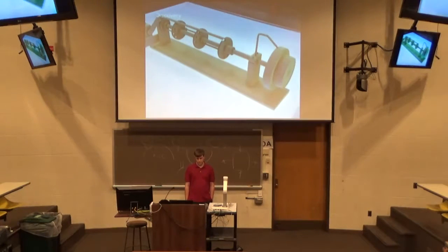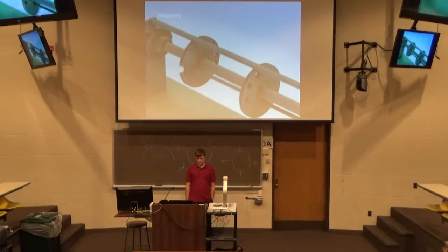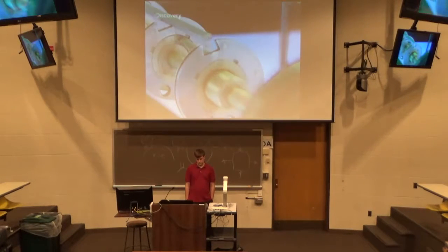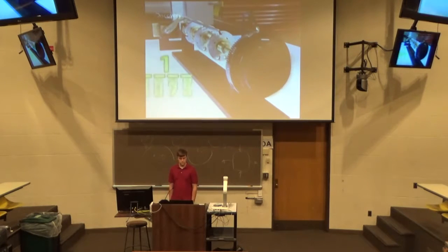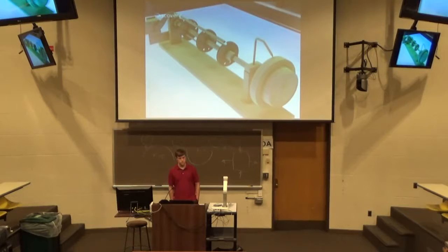For the second number in the combination, the dial is turned in the opposite direction, until the notch on the second wheel is also at the top, directly under the fence. The probability of randomly finding the first two numbers of the combination is 1 in 9,702.